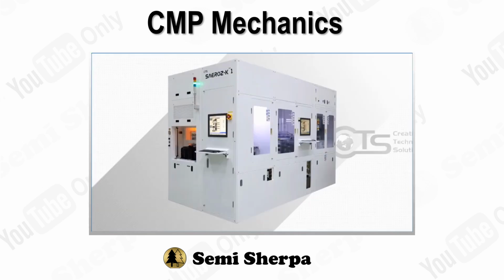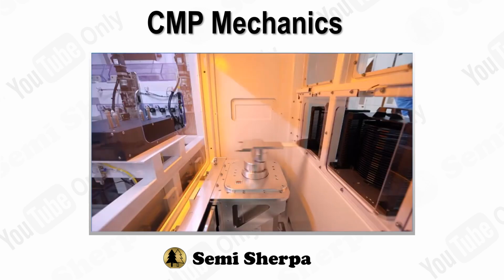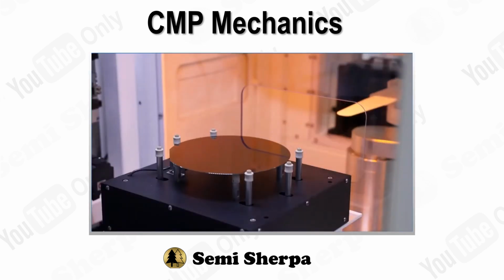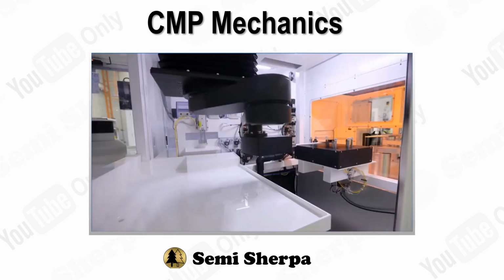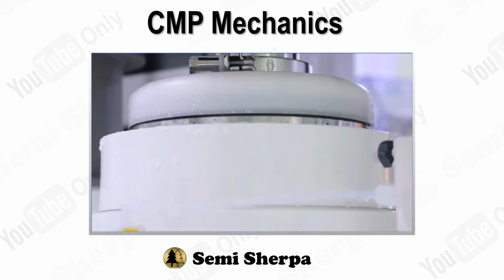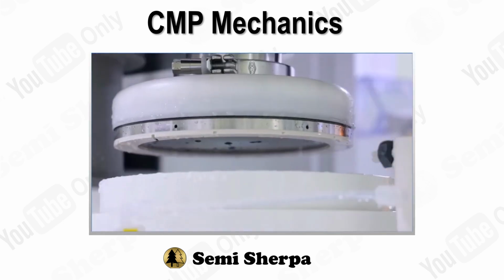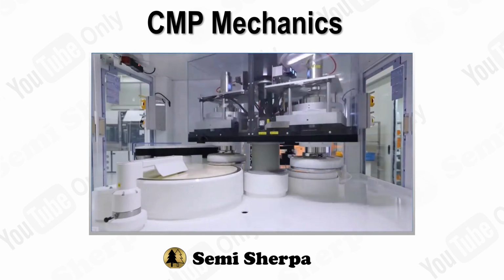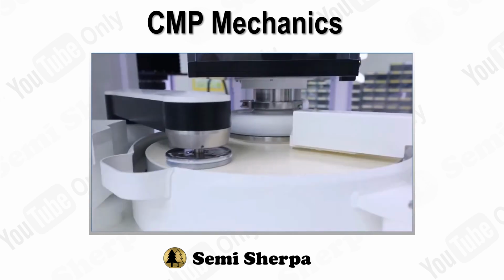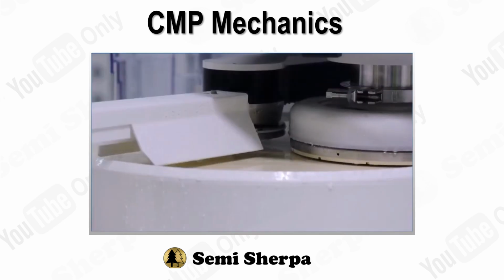Finally, we'll explore the endpoint detector, EPD, and integrated metrology systems that help control the CMP process. We'll cover the basics of motor current EPD, optical EPD, and eddy current EPD. Additionally, we'll provide a brief introduction to real-time profile control, RTPC, and integrated metrology for better in-wafer and wafer-to-wafer process consistency.